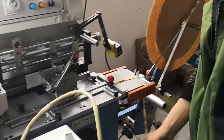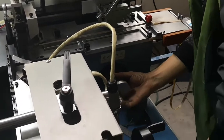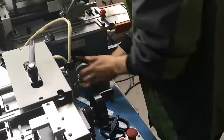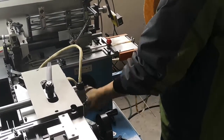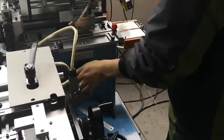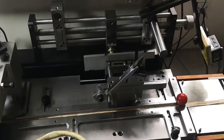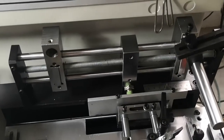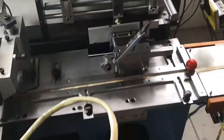For woven label cutting and folding, we should use this mechanical pusher, not an electrical pusher. The setting is easier. Normally, we just push the inching button to make the pusher move to the most right side, and set the label length as half the actual label length plus 3 or 4 mm. This is the label length setting.